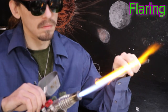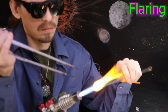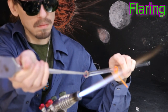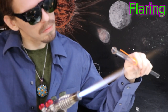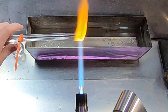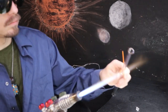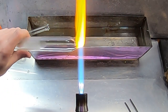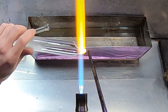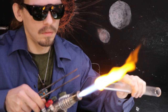What's mainly important here is the consistency of the rotation. That's really the best way to get the most even heat — to rotate it evenly. So I flared open one end of the blow tube to attach up to a slightly larger piece. The flare on that small tube will also help it from closing down during the attachment, because the heat will want to contract it and you'll end up with a restricted neck.